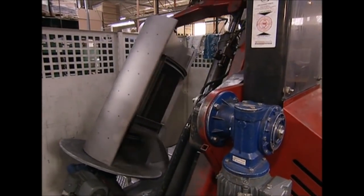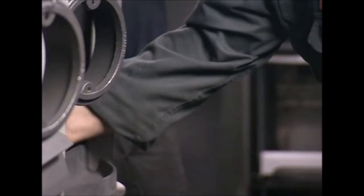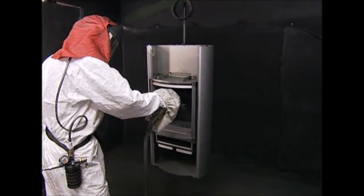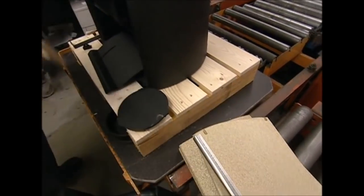The hoist lifts the stove from the chamber, and then the steel balls are tipped out. Then a tray for the ash and a cast iron grate are put into place. One of the workers hooks up an airbrush system and gives the whole unit a fine coat of protective varnish — it will resist temperatures of up to 600 degrees Celsius. Next, a heat-resistant layer of insulation is inserted into the furnace. It may look like cork, but it's actually a mineral called vermiculite.